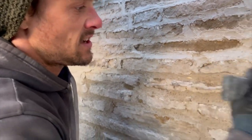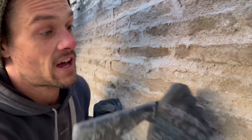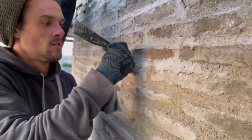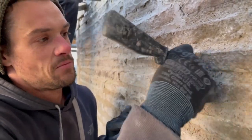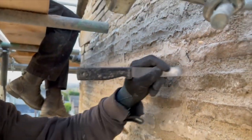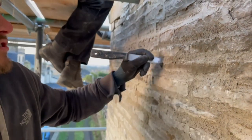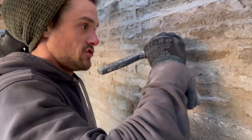You can see some of the granite coming through and a few exposed stones, but that's not an issue because each is surrounded by mortar. Some people quite like the appearance - it's something a bit different in the wall. The waste mortar we're scraping up can be reused. We're now in the fresh mortar section, which I'm just pulling out of the wall at that point - we can leave that and come back to it in a few days. The upper joints where the mortar's just been put in are scraped over to check, but they're not quite ready to be scraped off yet.